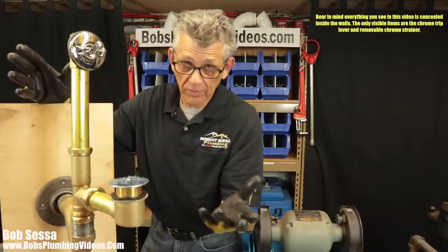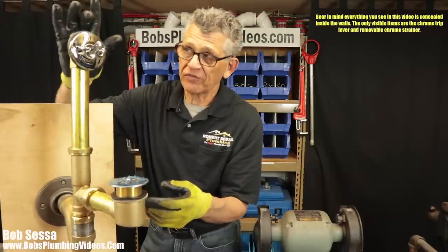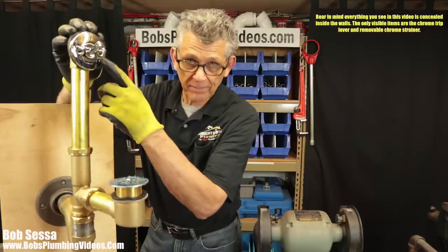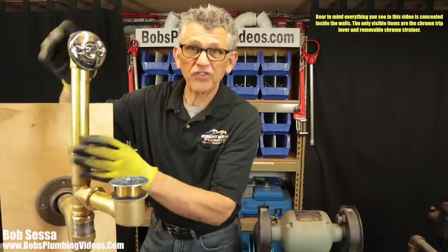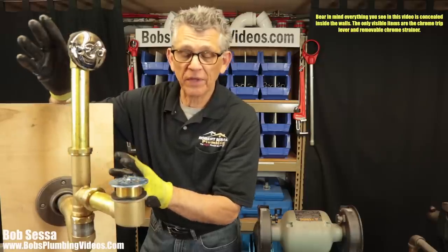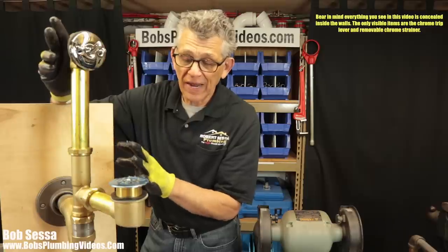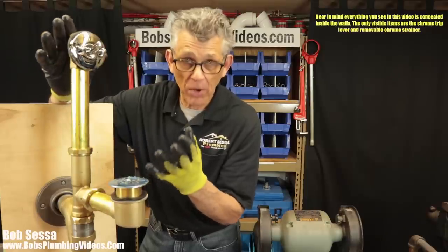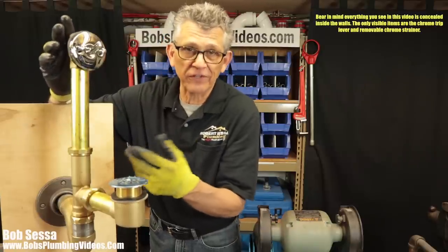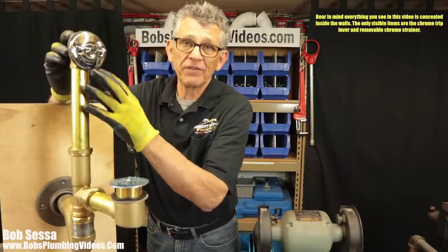Now, whether you call a plumber in or do it yourself, what you have to be careful of is that if you don't have that backup plate up top, there's a chance of this thing getting loose, shaking out of this tee, and you don't want that to happen. So what I actually do is, I've got to tell you, most of them don't have that backup washer. Most tubs that I go on to clean a stoppage out of don't have that backup washer.